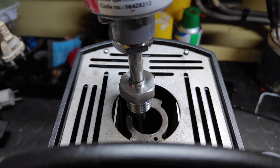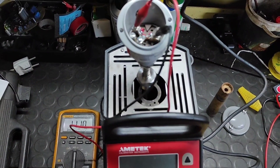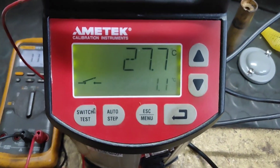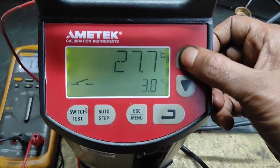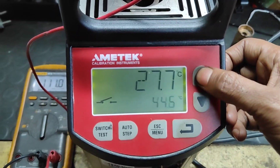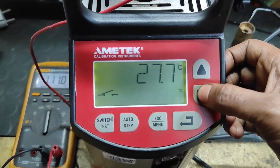There is a gap which is going to show a lesser reading because heat transfer will be delayed due to improper attachment to the calibrator. I'm going to switch on my calibrator and you can see it reads 27.7 degrees Celsius — this is the room temperature. At 27.7 degrees Celsius the ohm value is 111, as you can see on the multimeter.